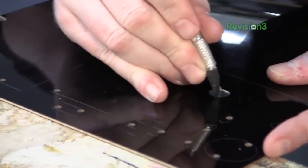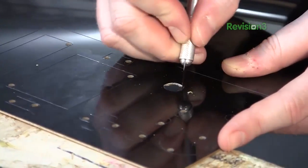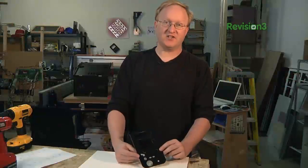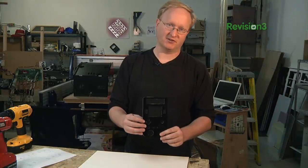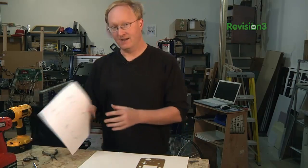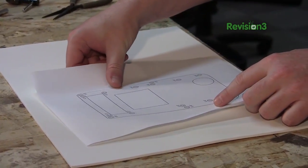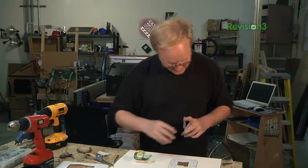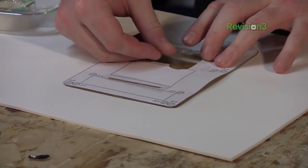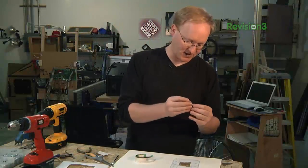You don't need any more blood on the Ben Heck's Show. I finished cutting out all the holes by hand using the pliers, a drill, and an X-Acto knife. Now we're going to place it face down and use this paper pattern in order to position the screw mounts. What I did with this design was to make markings for all the screw post positions.